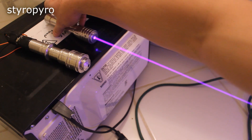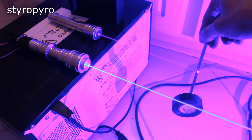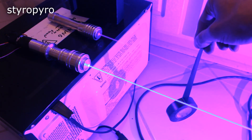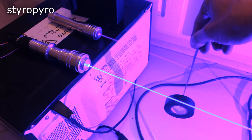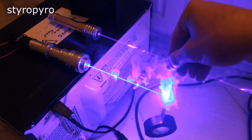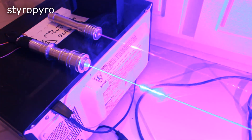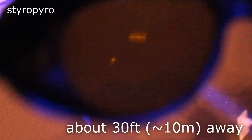You'll even see these effects in single beam lasers. Here I have two diode lasers — one's 1 watt violet and the other one's 6 watts of blue. Now up close, the blue laser is going to be a better burner because it has higher power density there. But I currently have these lasers focused so that their beam is smallest when it's far away from the laser. The violet laser is coming from a single spatial mode laser diode, so it has a much smaller emitting area, which means it can keep a much tighter beam and therefore have a higher power density at range.